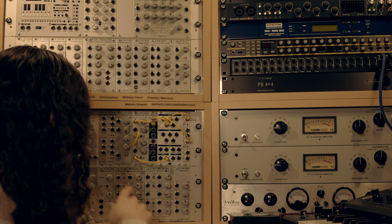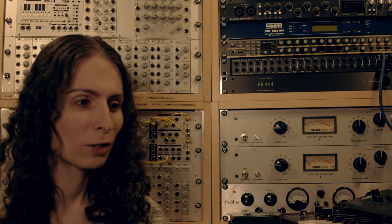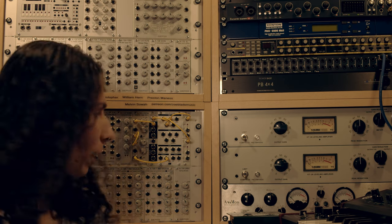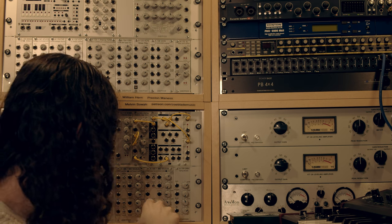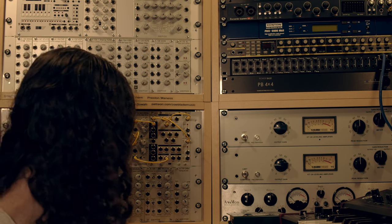And with this one, it's got 1024 capacitors in a row, which is two, and then double it and double it. And I think 10 times, so it's 2 to the power of 10. And this one's got 4096, so you double it again and again. And that's how many capacitors are in that one. And all that means is an audio signal goes into it, and then a short while later it comes back out again, having been through all the capacitors.